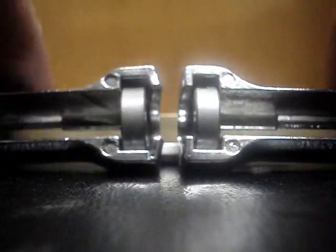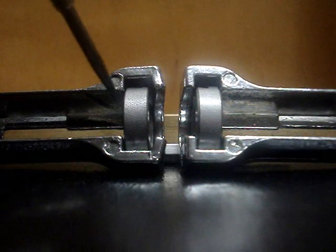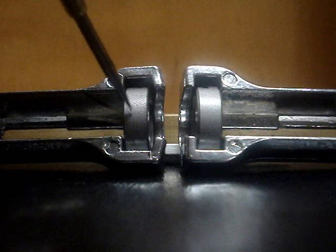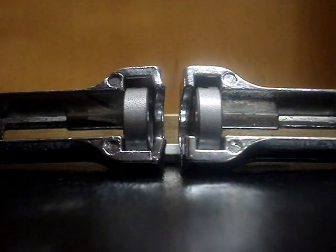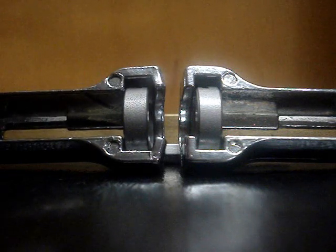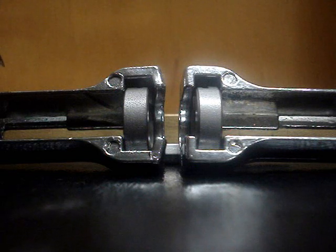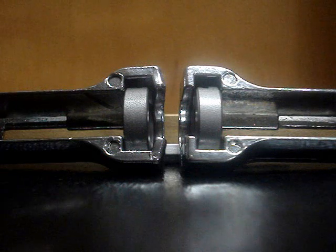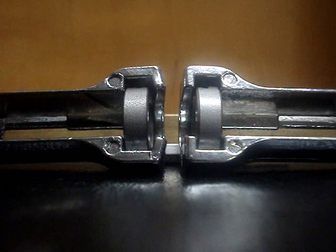You can see how much play there is in the worn one versus no play in the good one. What happens is when you push up, the force of the brass being pushed up causes the primer not to seat completely. So if I accidentally grabbed the worn one, I'd have to go back and finish seating on the good one or use the priming tool on the press. Just be advised: the Lee hand priming tool is a good tool, but don't overwork it. The other reason I'm keeping the worn one is for spare parts.